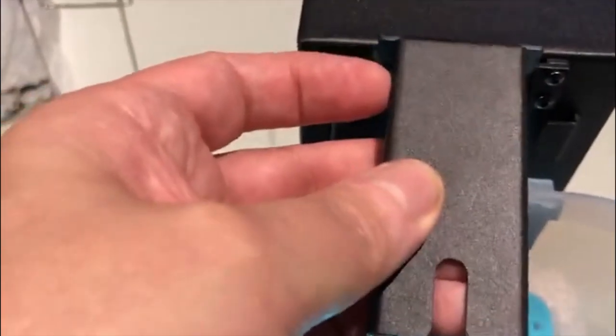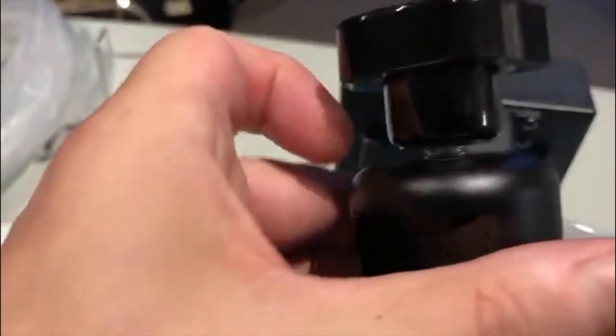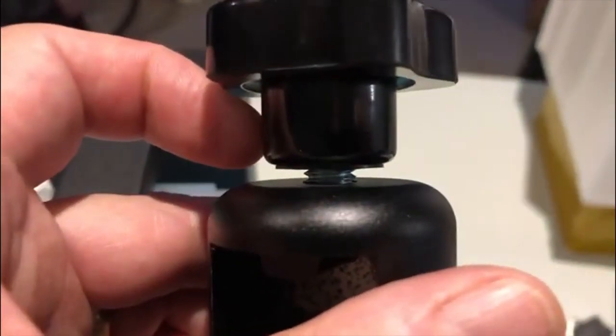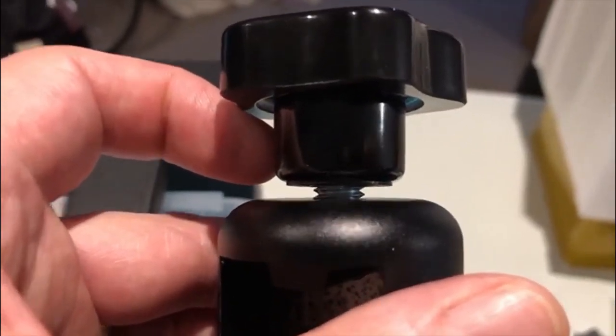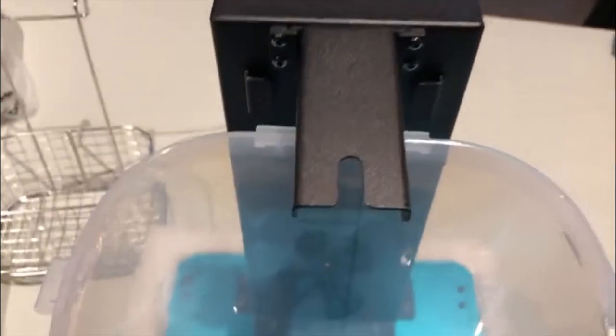One hooks on like that and drips in. Now if you were lucky you'd be able to hook this in somehow, but that doesn't appear to be the case because the bolt here — that little guy — is too fat. That bolt is larger than that slot. I believe cutting the slot will allow you to get it in, so that's one possible solution for Elegoo Mars users.